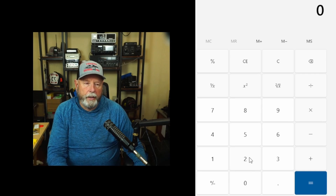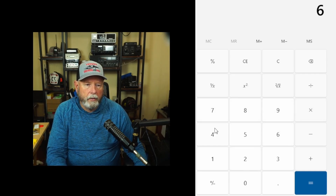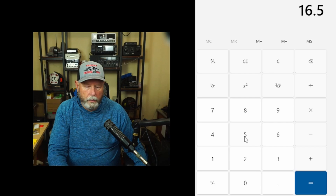Okay, here's the math I worked out. For the first 6 hours at 158 watts: 6 × 158 = 948 watt hours. Then for 16.5 hours at 185 watts: 16.5 × 185 = 3,052.5 watt hours. Adding those together gives 4,000.5 watt hours total. Dividing by the nominal battery voltage of 12.8V gives us approximately 312.5 amp hours.